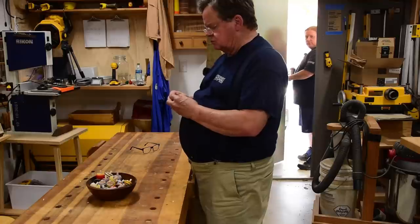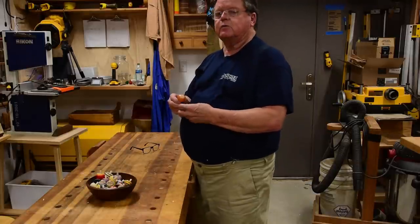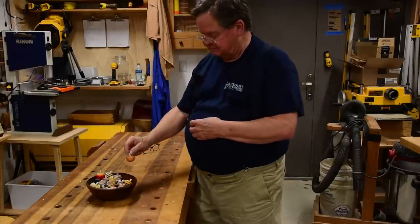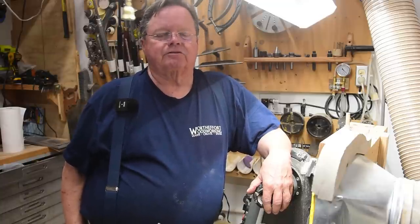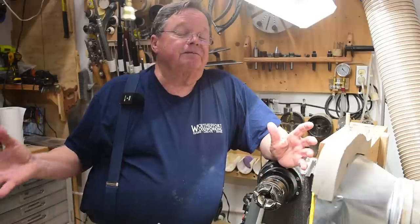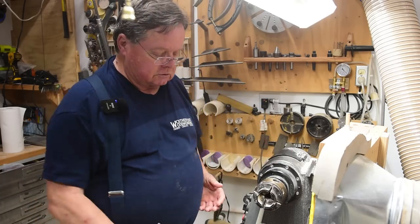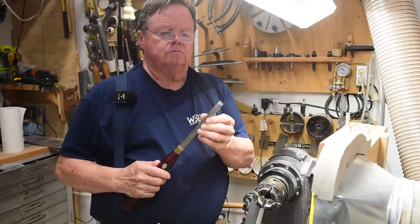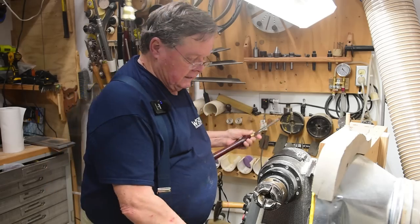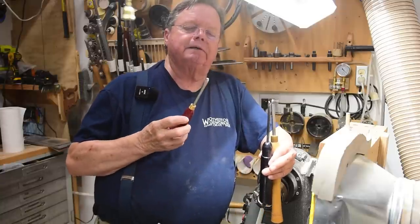Wait a minute, Sean — this has got tool marks. It's got ridges in it. They'll sell, Dad. Tell you what, let me show you how it's done right, not crappy like this. Welcome to my side of the shop. Sean does production — he likes to simplify tools and simplify processes. I tend to want to do things for fun and use the tools I'm comfortable with. So in this case I'm using multiple tools — I'll round it with a roughing gouge, use a small skew for peeling cuts, and do most of my shaping with spindle detail gouges.